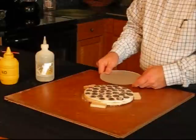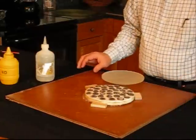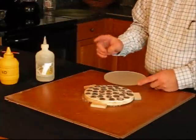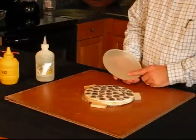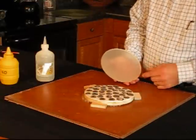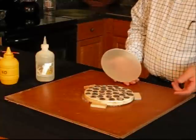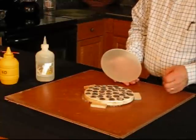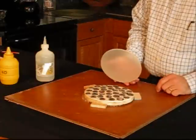The thing we want to accomplish in fine grinding is, one, to clean up the subsurface damage and bring the surface up to a polishable surface. The second thing is to control the radius. And the third thing is to make sure we control the wedge.